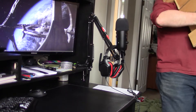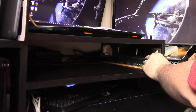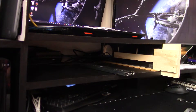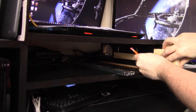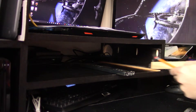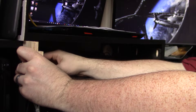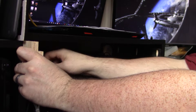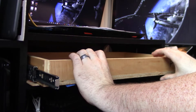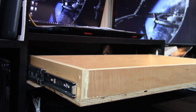With the finishing done and the final coat lightly sanded, I can bring the drawers up to the desk. I started with the hutch drawer. Using a quick jig I whipped up that gives me a square reference to the front of the cabinet, with a 7/8 inch setback into the cabinet and a paint stir stick as a shim up, I mark out the front of the drawer slide on both sides and screw them into place. Then using the same paint stir stick to lift the drawer box off the bottom of the drawer cavity, I can screw it into the drawer slides as well.